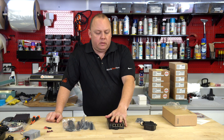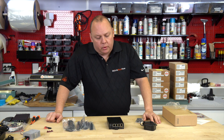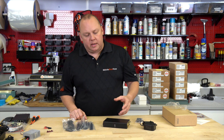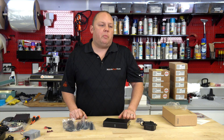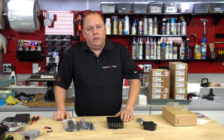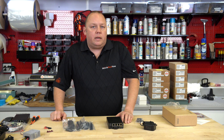In terms of specifications, this modem is virtually identical to the Transit Duo from a processor and memory perspective — 400 megabits max router throughput, with each CAT-12 modem having a 600 megabit max download throughput that channels through the 400 megabit router. As with all Prime Care modems, you get one year of InControl cloud management included, as well as SpeedFusion SD-WAN bonding licensing. InControl gives you the ability to look at the status of this modem and remotely access the management console to administer the device when you're away from the modem.